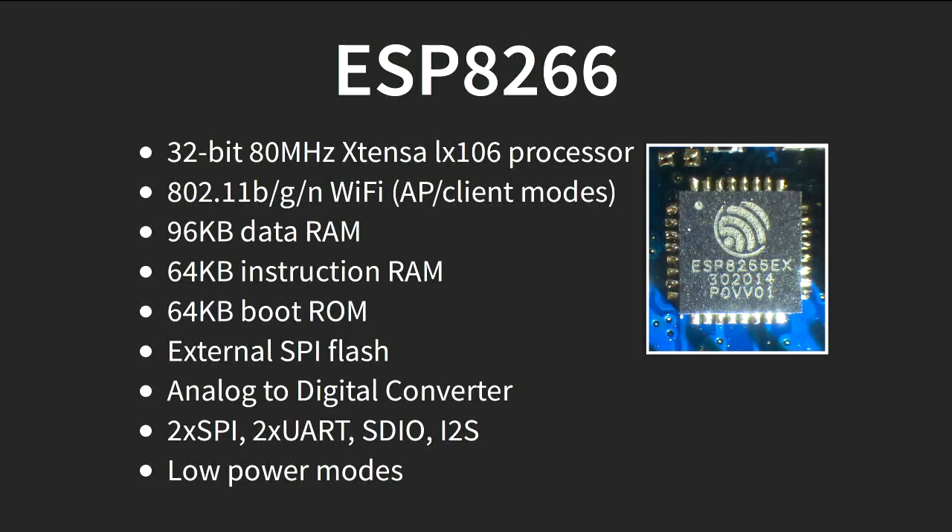It has about 100K of RAM in different kinds, a few external peripherals, and you can hook a whole lot of stuff up to it. The processor architecture isn't AVR or ARM — it's an Xtensa 32-bit processor — but you can still use GCC to compile C for it. It's made by a company called Espressif, and the real reason it took off is that it was really cheap: less than a couple of US dollars.